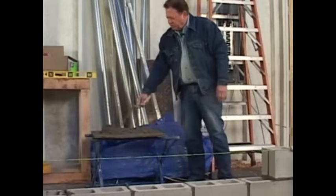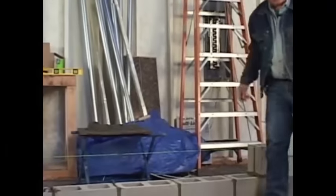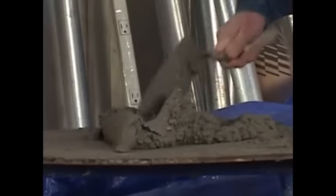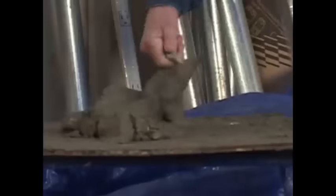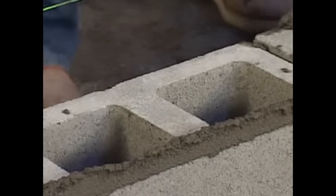This mortar is getting just a little bit stiff, so what I'm going to do is get that can of water and mix it up a little bit. Coffee can, a little water next to you, especially on a hot day. Work that water into the mortar, work it around like this. And this end, just move this way. There. Now we'll start laying this side in. That little snap on the trowel.